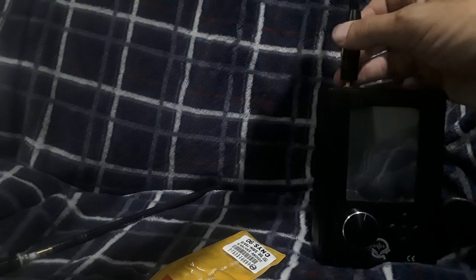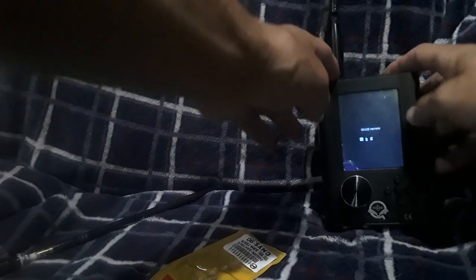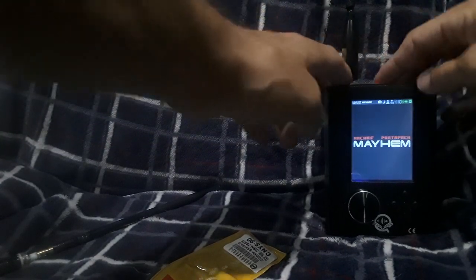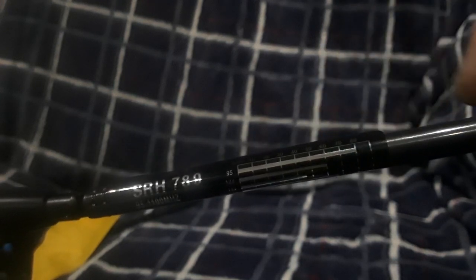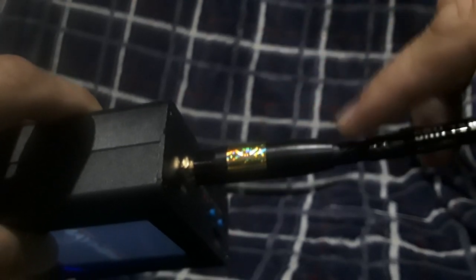I have to repair the first one I got because I was playing around too much. But this replacement is really excellent and I do recommend it — definitely recommend it. It's much more durable feeling overall. Just avoid ever twisting that bottom part, because if you twist it you're going to have the same problem: a broken antenna wire. The SRH-789 is what you're looking for. There are other similar ones as well, and what's nice is it has measurements for antenna tuning. If you don't want to spend 40 or more dollars for the official, you can go with one of these for about $10.